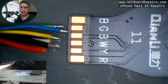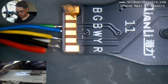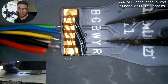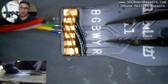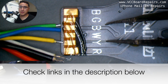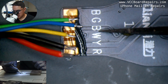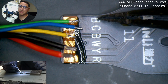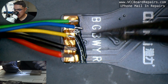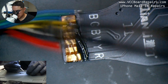Let's get started. Get some flux and apply it to the pins, and use your tweezers to hold things down. For the cable, you want to make sure you have something heavy holding it down — I use a 2x2 inch steel block, I can link it in the description below. You'll see there are letters here: black, green, blue, white, yellow, red. Black and red are always at the ends, and they are larger because those are the power and ground. The center ones are the data lines.